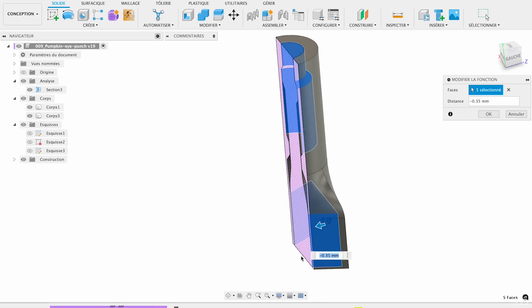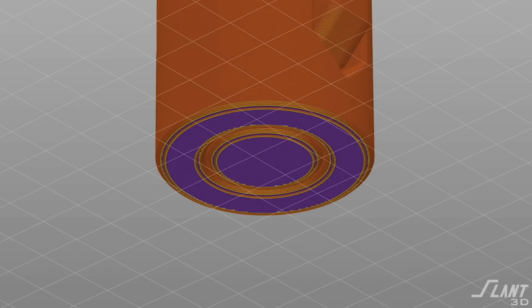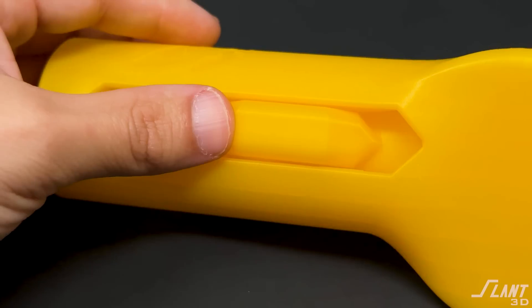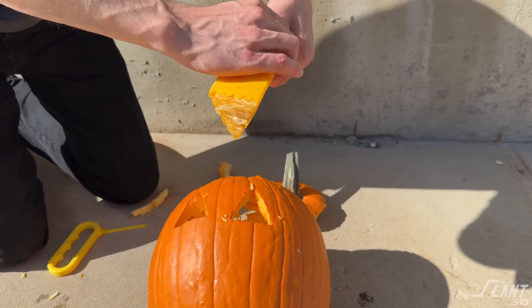While we printed it vertically, the stock is on the backside. Now, the plunger actually contacts the bottom of the print bed as well. If you start with the plunger forward and punch in an eye hole, the plunger is now halfway in and you don't have a big lever to shove it through, so you need to access the plunger from the back. We put flanges on the sides so you can slide it up and down very easily and get access to it.